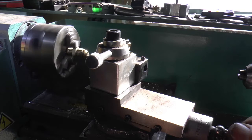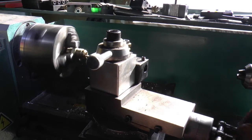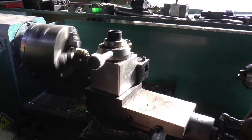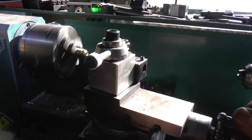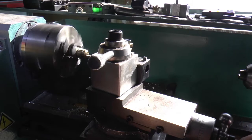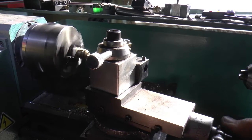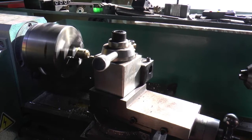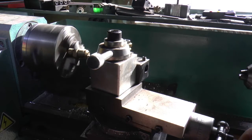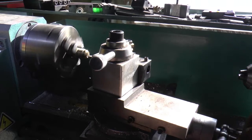Like I said, first starting out that boring bar is just a little bit fat — you can see it wiggle a little bit. But once we get started and get a little clearance, we'll be fine. I found that I only go about five or ten thousandths at a time. That way I keep a nice clean smooth cut. Brass is kind of different to work with, and I think they do make these in steel which might be a better choice, but this is what I have. If I have problems I can always do the same thing in steel.